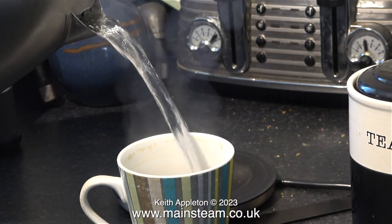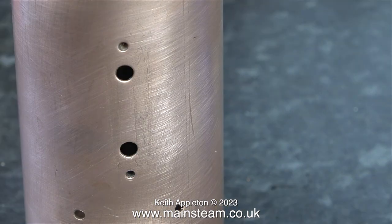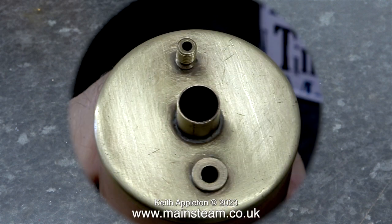Later on in the day I removed the boiler from the tub, and I was pleased to see that the Kilrock K had also attacked the damaged lacquer coating that was on the outside of the boiler, which made it very easy to remove with some Scotch-Brite. I cleaned up the entire boiler the best I could, and as you can see it's a lot cleaner than it was.